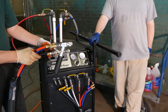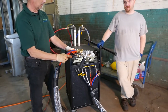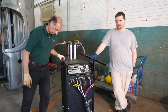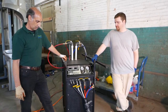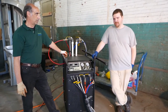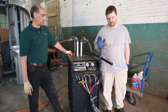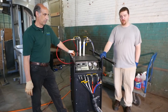The MPF-C30 is a 30-amp machine requiring a 220–240 volt power supply. The heater is 3,800 watts, using about half the total power draw; the motors use the other half. The pumps do about one gallon per minute per side, for a total flow of two gallons per minute depending on viscosity — measured at the hose connections. Flow rates out of the gun will be completely different.